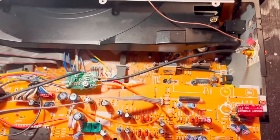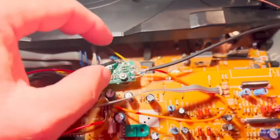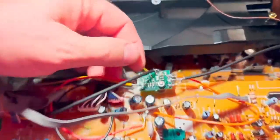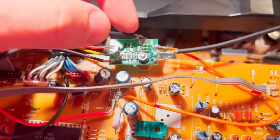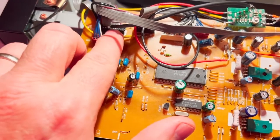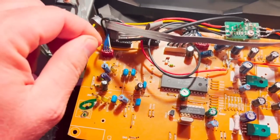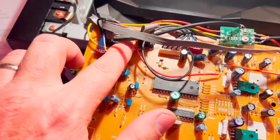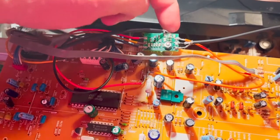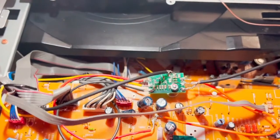I want to walk you through the final product before we test. Forgive the shaky camera work. Here's the board, installed in that empty socket along the bottom edge — because of course this is going to flip over. Here's the coax coming in from pin 6 on that connector. The instructions say you can scrape back some of the sheath, but I opted to pull all the pins out and wedge the pin in and reinstall — so I didn't solder or scrape anything, I didn't want to damage the cable. This is just wedged in with that particular pin. You pull back the plastic, unbraid the shielding on the outside — that becomes your ground — and then the data wire solders to that point right at the top. Very delicate, very fragile.